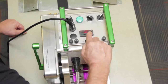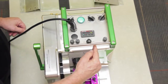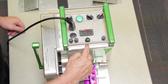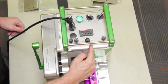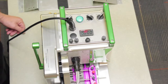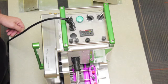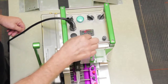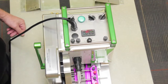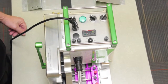In addition, we have the speed control located here. The dial indicates zero — no movement at all — up to 100% of the motor's capability. At 100%, you are running at roughly 33 feet per minute or 10 meters per minute. Therefore, at the 50 position, you are running the machine at roughly 15 to 18 feet per minute, or about 5 meters per minute.